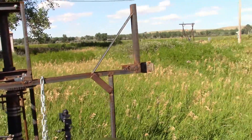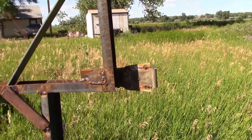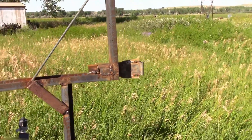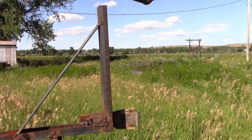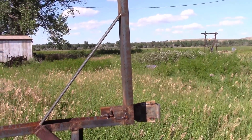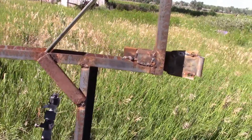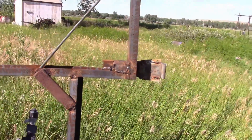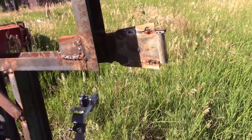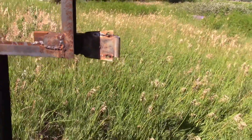My earlier attempt at setting up the boom was off camera — I bought some crappy hinges and thought that should hold enough if I put a little cable off the top. That didn't work out. This piece actually bent through here once I had the weight on, and of course I had already welded it on, so I ended up taking a plasma cutter and hacking it off.